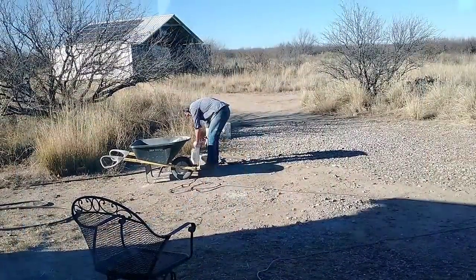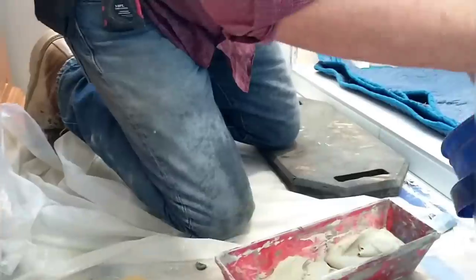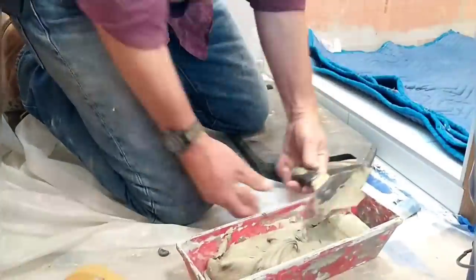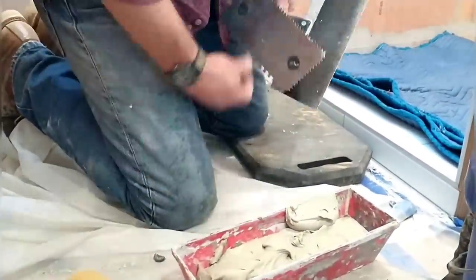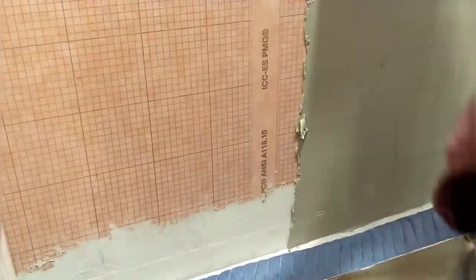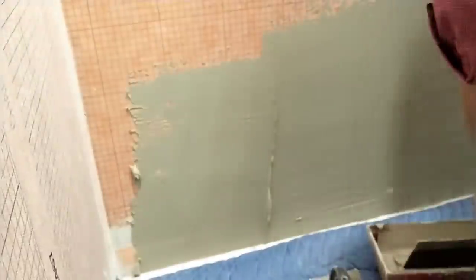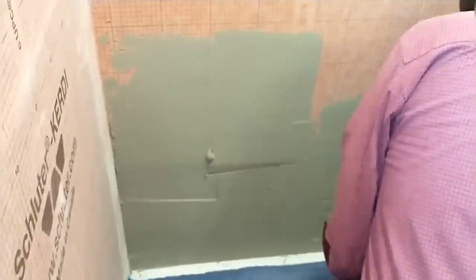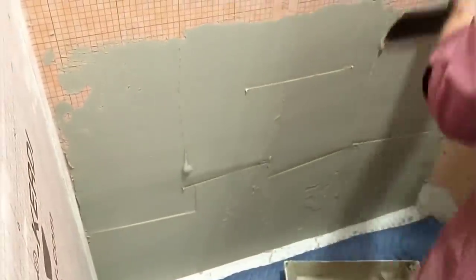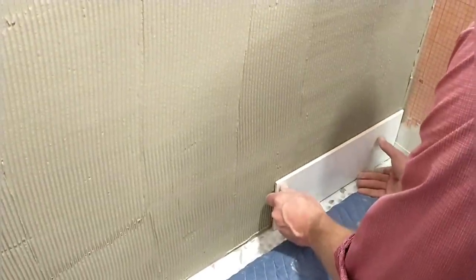Here I am mixing up the first batch of mortar and getting ready to install tile on the first wall. We'll be using a rather large and plain white porcelain tile, which will serve to break up the more textured tile we'll be using on the other two walls. I'm starting by putting on a wet coat to cover the wall with mortar, then I'll come back in with the notch trowel to put in the lines. I'm doing this in small batches — two or three feet of height at a time — so the mortar doesn't dry before I get there.